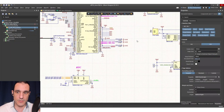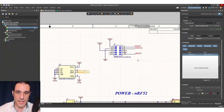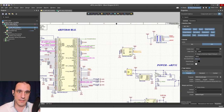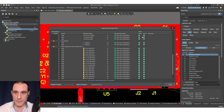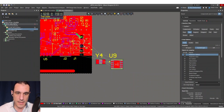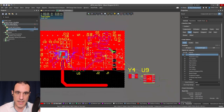I've actually made some changes in the schematic. I added a new circuit, a real time clock, and swapped out the debug header for an SWD header. This is what we're going to use to connect this board to a Presto programmer so that we can flash it with firmware. Since I've made these updates, I'm just going to go ahead and import them into the board and make sure we validate everything. Even though we had a few errors in the initial check, everything imported properly and we've got our new stuff imported. We're going to have to do some cleanup here on this connector and do a little bit of rerouting, but we'll get that cleaned up and then get this into production.